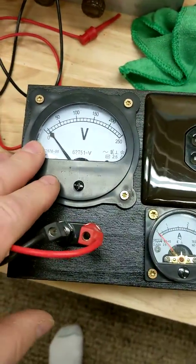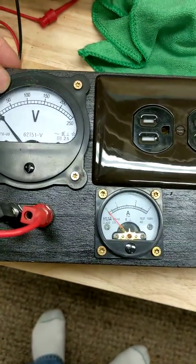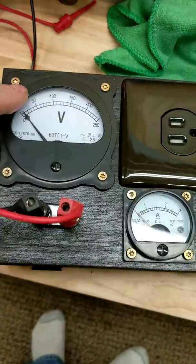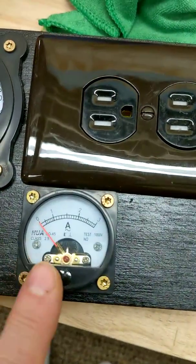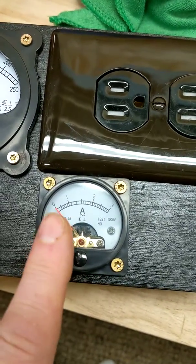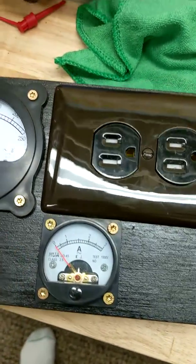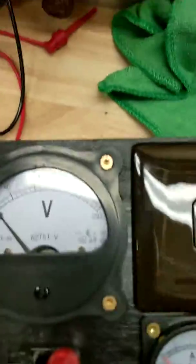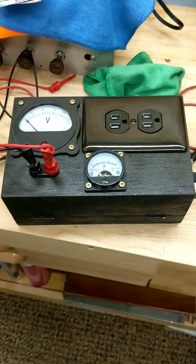As you increase your voltage on your variac, you're going to see the voltage increase on here. Most of my household current around here is between 115 and 120 volts. As you're turning that up, you're watching your amps on this amp meter. If they go higher than you're anticipating — in this case anything higher than one amp would set off bells and whistles with me — that would typically show up at lower voltages. You wouldn't want to go any higher until you've figured out why you're pulling such high amps, like maybe you've got a short to ground.